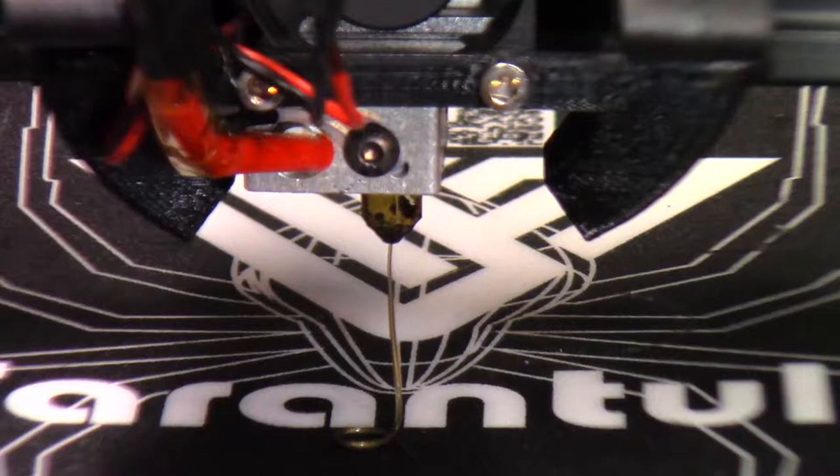Notice how it's not oozing out from the nozzle a whole lot — just a little bit, starting to move off to the side. That's actually about where I want it. If it was oozing out really fast I'd want to turn the temperature down, or if I was having a really hard time pushing the filament through I'd increase the heat until it starts to ooze a little bit like that. That is easily controlled with retraction, so that's going to be just fine. Now that I know the right temperature, I'm going to slice my model.